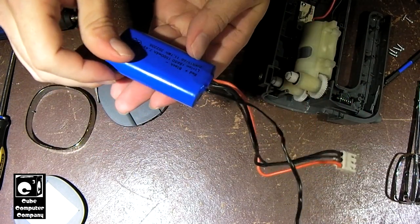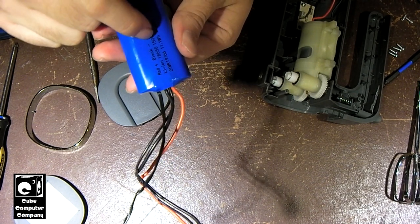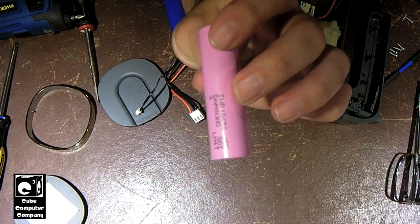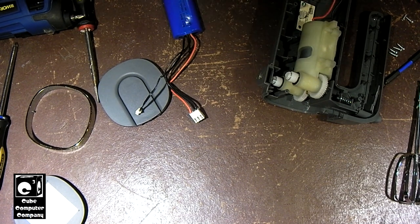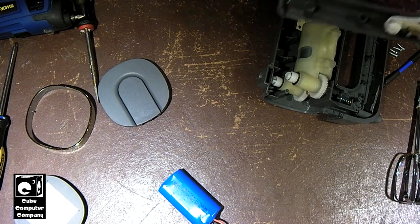This battery claims to be an INR pack. I'm not entirely sure — it's only 1500mAh. For comparison, I have a brand new set of Samsung INR cells that I use to power the storm cams for CubeComp MDX, and those are 3500mAh — quite a huge jump from 1500. 1500mAh is normally what you find in cells designed for high drain, so hopefully these are in fact high drain cells, even if I'm not sure they're truly INR.